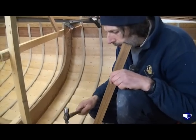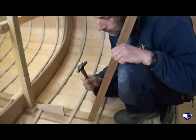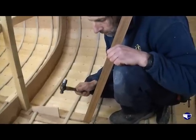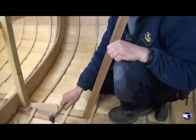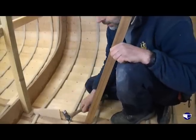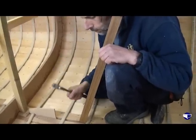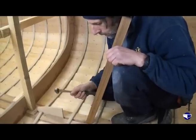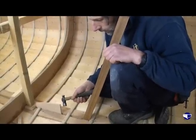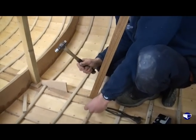Just working my way round the head, round the end of the nail with the round end of the hammer, with not big hits really — it's all in the wrist action rather than the arm action. The guy holding the dolly against the outside of the boat doesn't want to be hit too hard really.